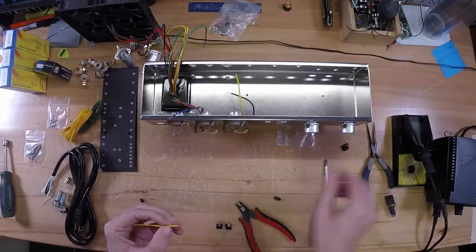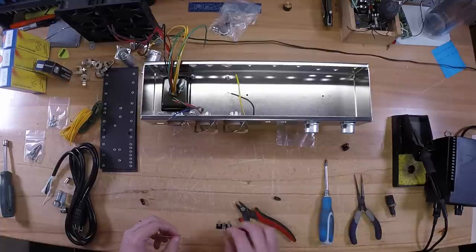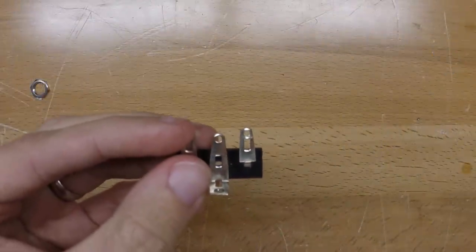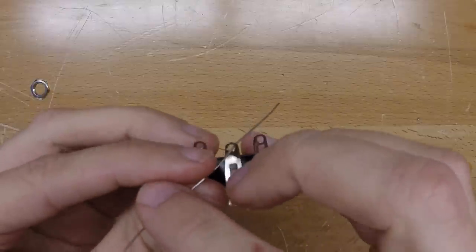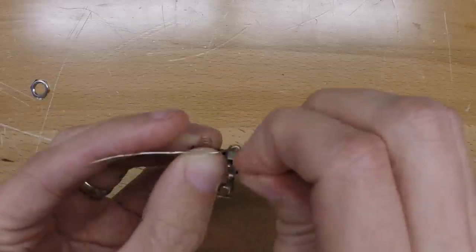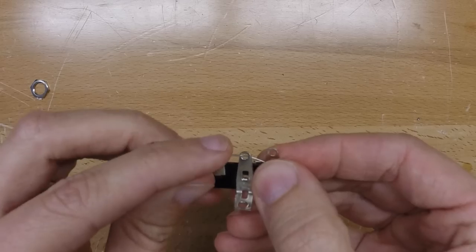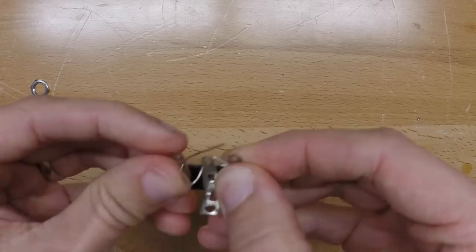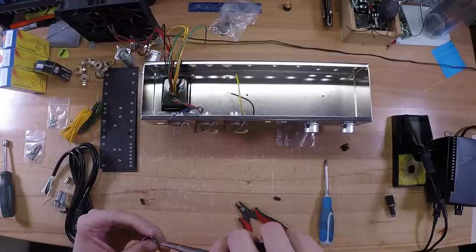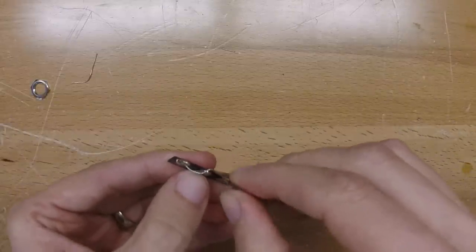So what you want to do is get a piece of wire, and you can use the 22 gauge with this. Just pull back the cloth wire and you can actually pull the whole piece out with the needle nose pliers real easy. Take the piece of wire and feed it through the center hole just like this, and thread it around into the outer lugs. Loop it around into that lug and make a good solid mechanical connection. Then do the same thing with the other lug as well. You can use the needle nose to tighten up that connection and make it real nice.